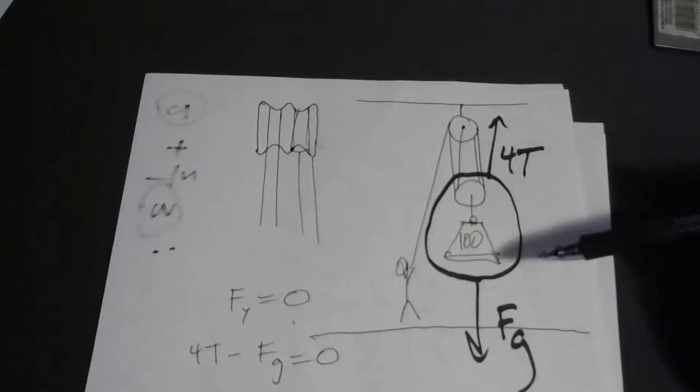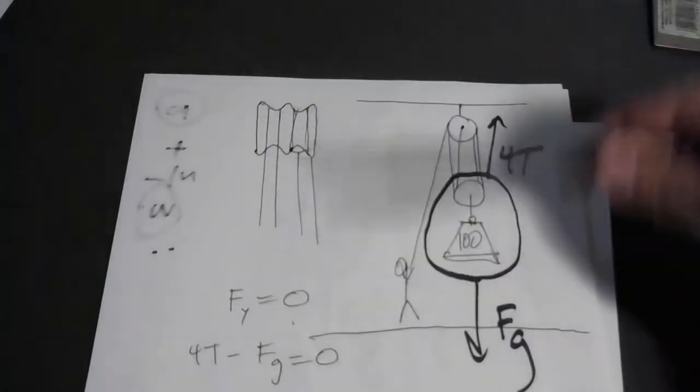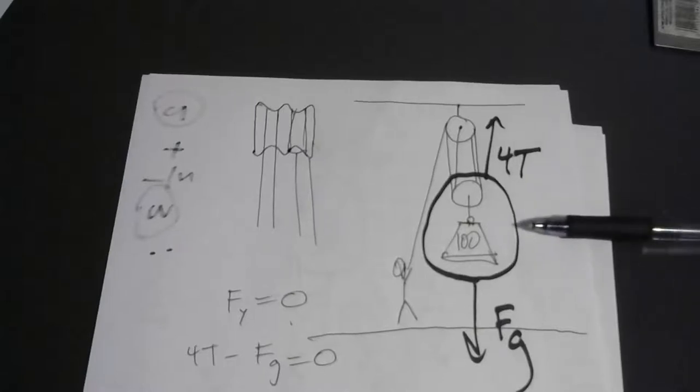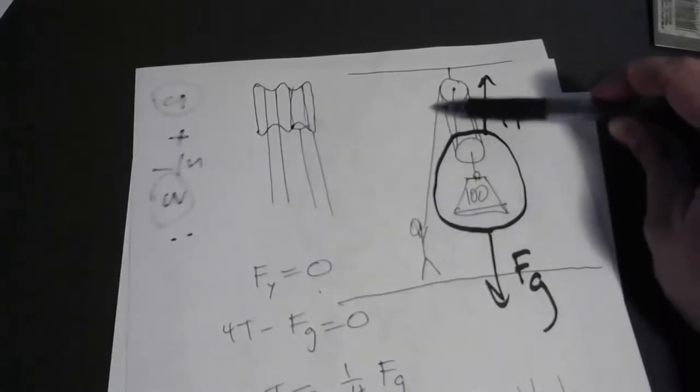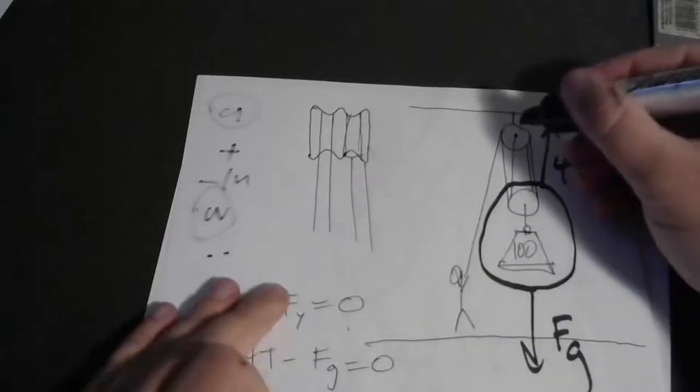It's interesting to ask what are the limitations to this. We started with a mechanical advantage of one to one, then two to one, four to one. Can you just wrap this around many more times and get a mechanical advantage of 10 to one? Well, of course, you can't just stand in a garage and lift a cruise ship. The rope would break well before you could lift something that heavy, and you'd also bring the whole building down. Also, if you draw a bubble around the fixed pulley, you can count five contact points. For this 100 pound weight, the tension in the rope would be 25 pounds — 25 times five gives 125 pounds pulling down on the fixed pulley, meaning the tension in the chain connecting the fixed pulley to the ceiling would have to be 125 pounds.